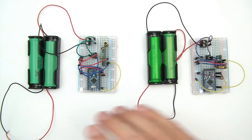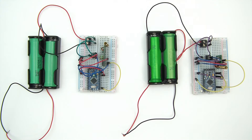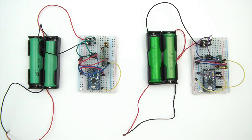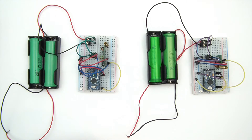I've got the transmitter and the receiver. Five times a second, or every 200 milliseconds, I'm transmitting a message from this one to this one. Now the size of the message does matter — generally speaking, the shorter the message, the more likely it is to get to the receiver. That's because they have a checksum. All of these transmissions are subject to external noise from the environment, as every other radio technology is. With this checksum, if the message gets corrupted by external noise, it's dropped at the other side because the checksum doesn't work out. So if you have a shorter message, there's less chance of it getting corrupted.